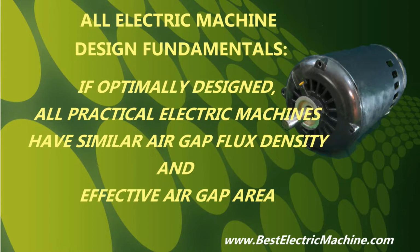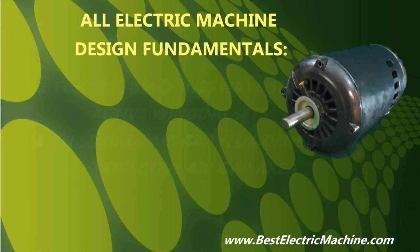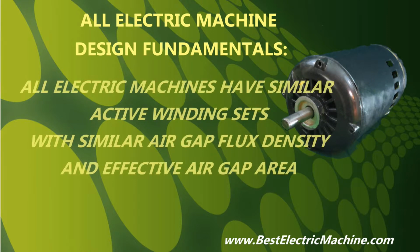as a result of saturation. Therefore, chiefly constrained to stay within the same flux saturation limit of the same available core material used by all, any practical, optimally designed electric machine with a given power rating will necessarily show similar air gap flux density and effective air gap area, regardless of the magnetic energy product of rare earth permanent magnets or the even higher magnetic flux potential of a winding set with magnetizing MMF. It follows that an active winding set of any practical, optimally designed electric machine with a given power rating is constrained by similar air gap flux density and effective area, and as a result, will show similar cost, energy loss, size, thermal dissipation, power to volume, and power to weight.